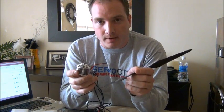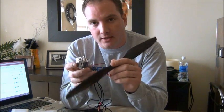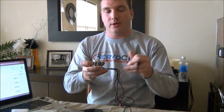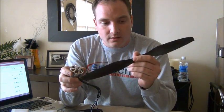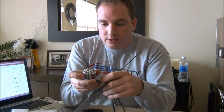Something you have to remember — and I can't stress this enough — one of my customers in the Dominican Republic almost lost two of his fingers. It was one in the morning and he felt like updating the firmware on INAV, because INAV just came out with 4.02. He failed to take the props off his Matrix, and when he plugged it in — even though there are warnings on the screen — he thought he could hold it down. The props spooled up to full power, because when you update firmware on INAV, it spools up to full power.